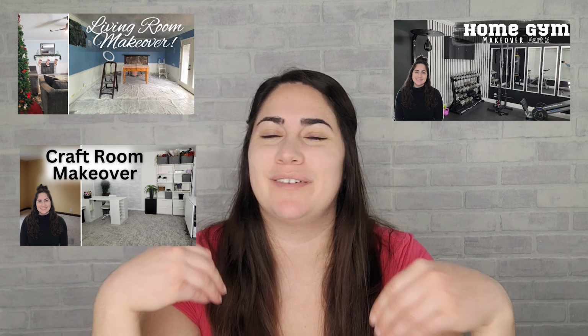So if you have not watched any of the videos of our home makeover so far, I will give you the rundown. In our entire house, we had all of the popcorn ceilings scraped. Then we had someone come in and do the patchwork and skimming. Especially on the bathrooms, we had them do a skim coat on the entire thing just to make sure it was good to go. Then we sanded it down ourselves and primed it and painted it. So we got that taken care of, and that was first things first.